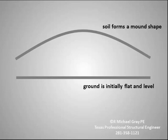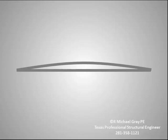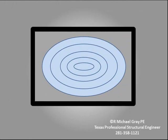The result is that what starts out as level ground assumes a mound shape as shown. This slide shows how the soil mound grows over time. Eventually the mound will stabilize, but this may take six to seven years. The oval lines in this slide show the soil mound as viewed from above, as if we could see through the concrete. The highest point is a small oval in the center, and the lowest part of the mound is the largest oval out near the edge.